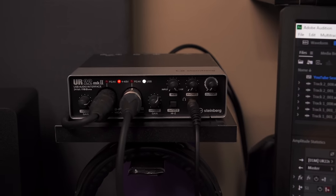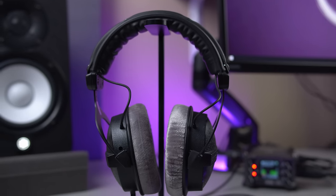Normally for this process I would use a combination of devices. If I was recording at my desk, I would do all the interfacing and Audition stuff with my Steinberg UR22 Mark II, which for the most part is a pretty darn good interface for the money. I have experienced two issues with it, however. One, the headphone volume isn't the greatest and it does struggle to drive my DT770s. Two, I've been experiencing audio drift in my recordings — I always had to rate-stretch my recordings by the smallest percent to get it to line up with my in-camera scratch audio. I tried everything to fix this: different software, different drivers, ensuring the sample rates and frame rates were reporting correctly and consistent across the workflow. And no matter what, it always drifted just a tiny bit. It wasn't really noticeable until you recorded over 10 to 15 minutes, but it always kind of bugged me.